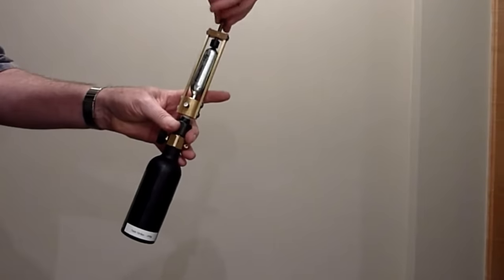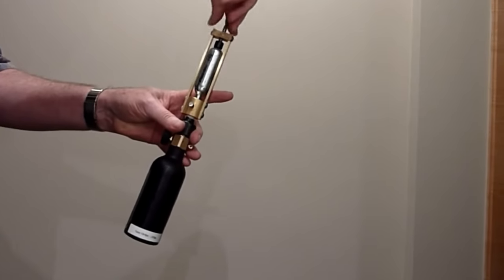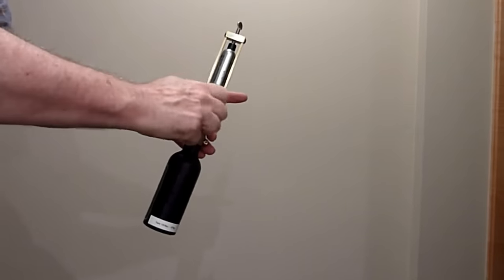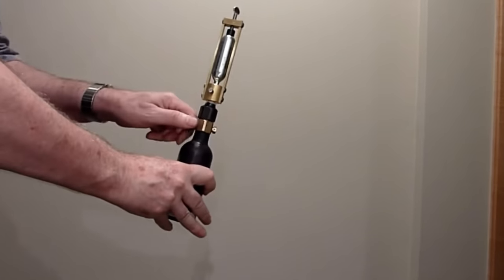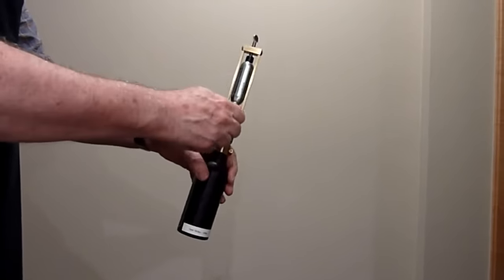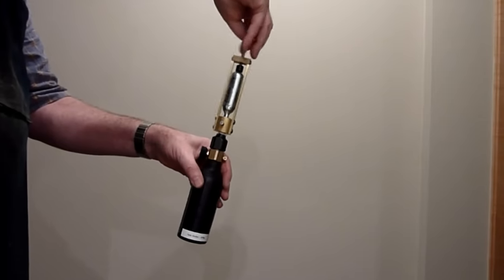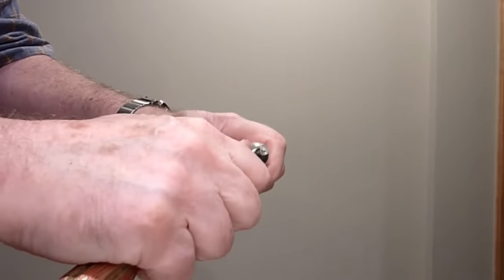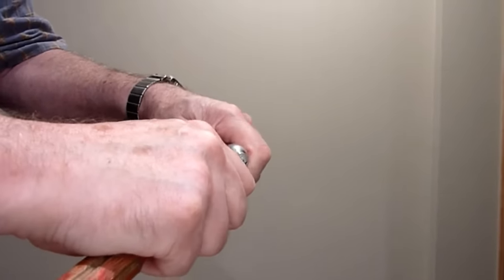Place it in the loader, tighten the restraining screw just slightly, and make sure the bleeder valve is closed. With the tank upright, open it for a second or two, then close it, bleed off excess pressure, and then bleed the cartridge. Bleed off pressure until it's almost empty, leaving just a little bit of pressure.